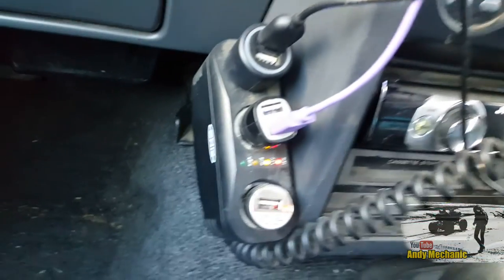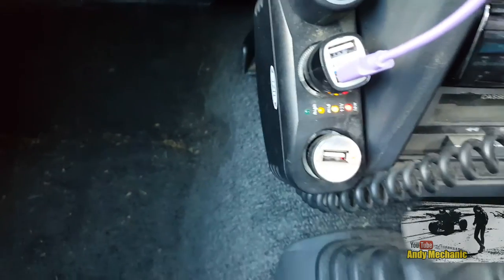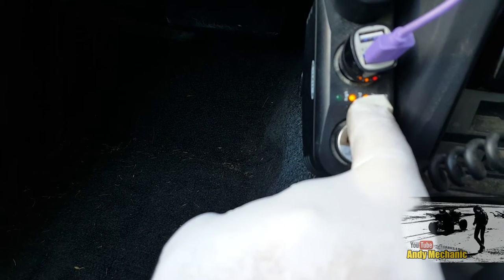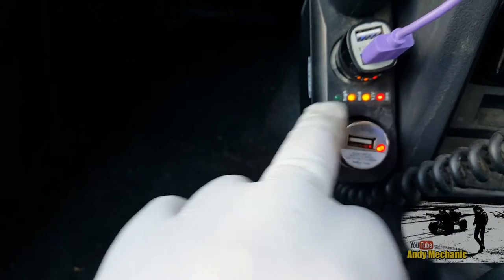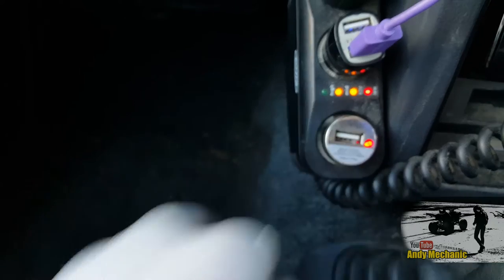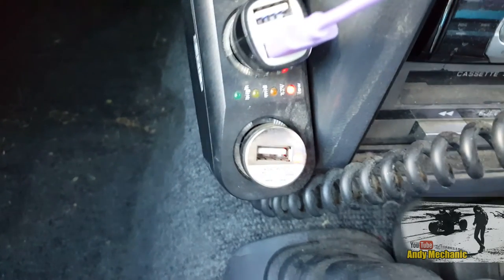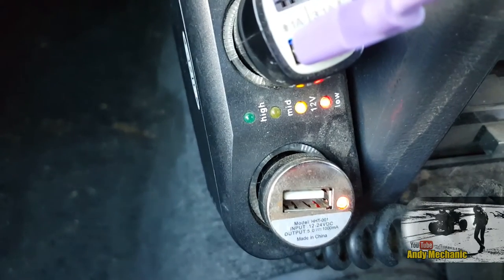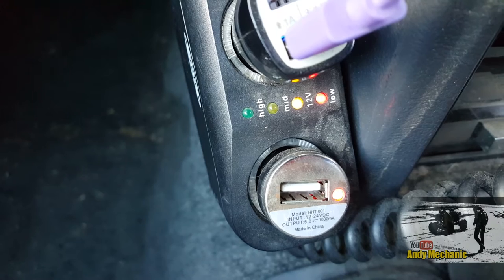Just down here I have a little adapter for my chargers and you can see only two of the LEDs are lit. So we've got 12 volts, middle charge, high charge. The battery's currently on charge, we've got a charger on there. But normally, once we start the engine, that green light there would come on which tells us that the alternator's fully charging. So I'm going to start the machine up and give it a bit of a rev — we've got to wait for the glow plug timer to go off. Giving it a rev isn't taking it up to what it should do.